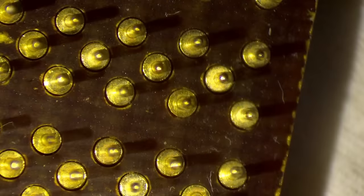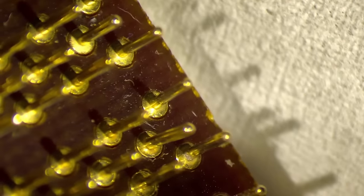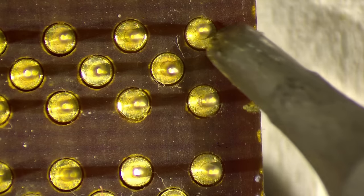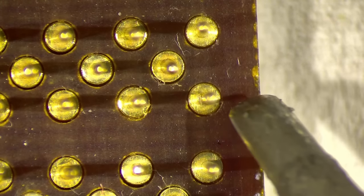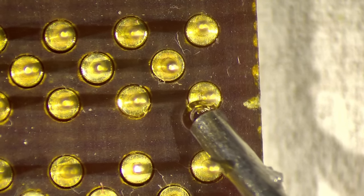It's nice that they're still attached a little bit. I could just try to solder them, but I should do this right now — I will never find these pins otherwise. This is also one in a cluster of five. My soldering iron versus these pins — well, this is not too bad. I could probably re-solder these ones since the crack is exactly on the other side. In the worst case I have to take the pin off and solder something else on there. Let's try — I definitely need flux around this one.